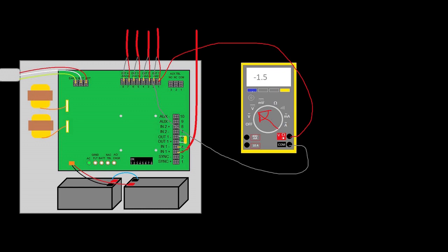If it were a fire panel, these voltages would probably be different, but they're all going to do the same thing: they have a negative voltage in a normal state, they reverse on alarm, and that voltage increases on an open circuit somewhere out in the field. So let's assume we put our meter on output 1, but instead of getting 1.5, we're actually getting negative 3.0 or something close to that. If we get negative 3.0 there but negative 1.5 on all the other outputs, we know we have an open circuit.